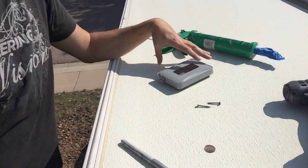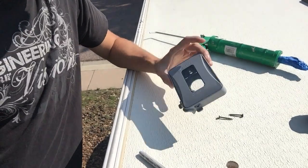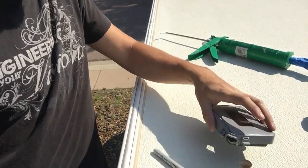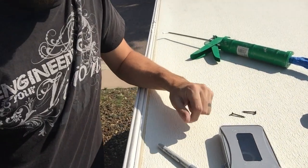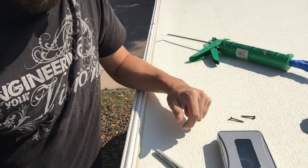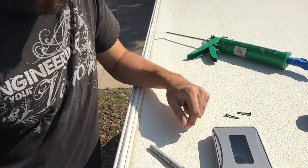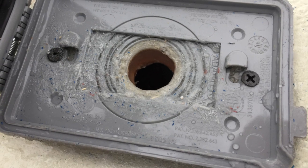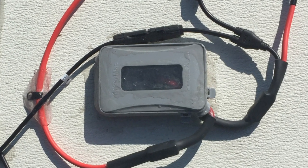Okay, here we are on the roof — I've got my hole drilled. I've got my supplies here: this is a weatherproof box we're gonna use. It's basically made for outlets on the exterior of a home, but it's got a little lip that covers rain and it's all rubber-sealed. We'll use some sealant heavily around the outside to make sure we don't have any leaks. The box is all weather-sealed up — I used RV Pro Flex to seal it. It takes several days to harden, and I know it isn't the cleanest-looking project, but it does the job.